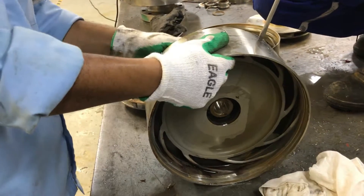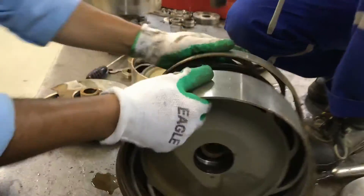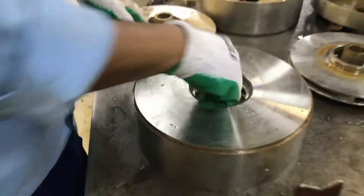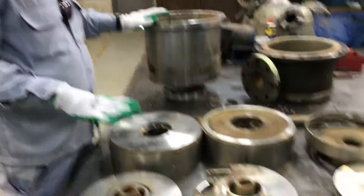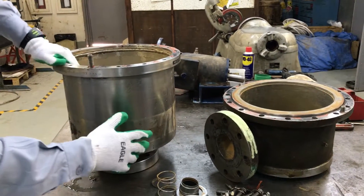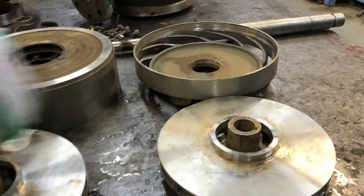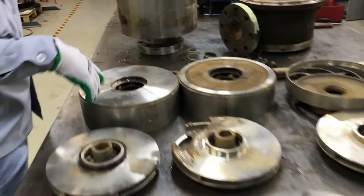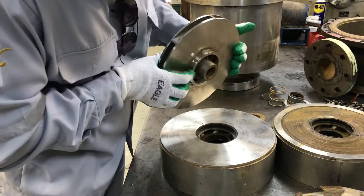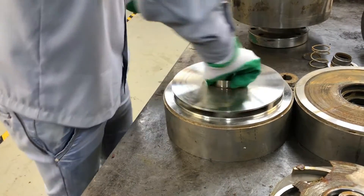The pump has been fully dismantled. You can see the pump casing is split into two parts. You can see the shaft and the impeller casing. These three are the impellers and this is the impeller casing. This is the top wear plate — normally the impeller will be placed in such a way, with the impeller neck fitting against the wear plate.